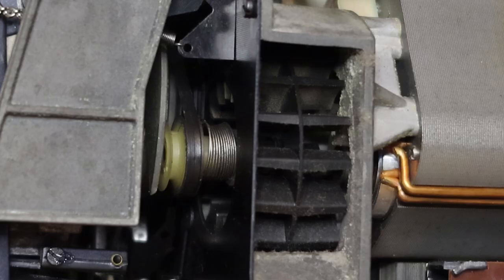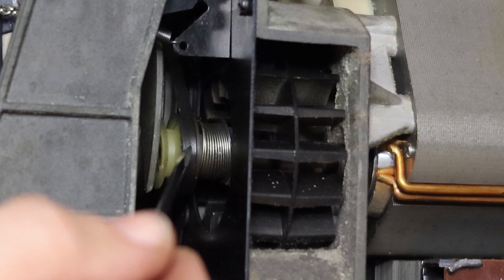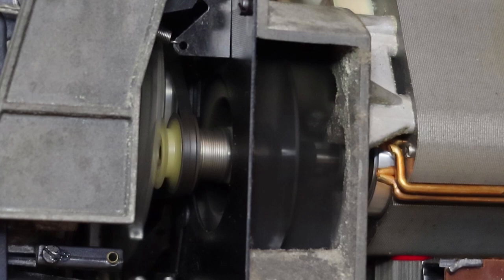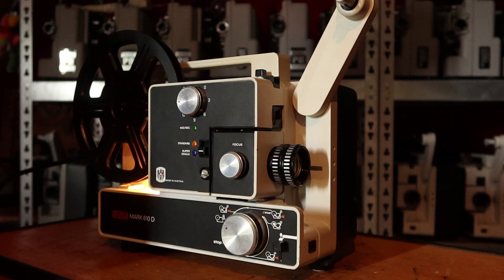The lack of power can also be a problem, as the motor does not have enough kick to get the claw over the cam lobes from a standstill. Therefore, on the motor there is a spring-loaded pulley, so the motor has a little time to get up to speed and can kick the mechanics into motion.